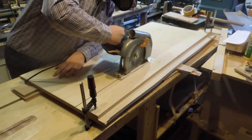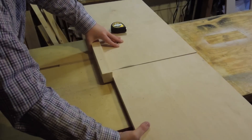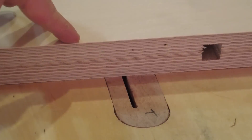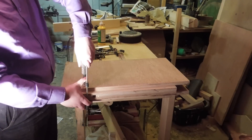The first thing to make was the table part and the conveyor to see if I can make it work. The surface is made from two boards of 18mm birch plywood and I routed a slot for the pivot rod before gluing them together. The plywood wasn't terribly flat so to encourage the boards to remain so after gluing I clamped them together with some flat boards.